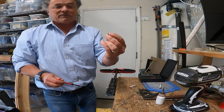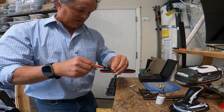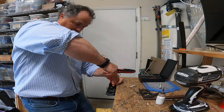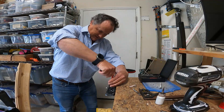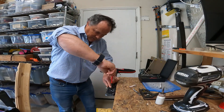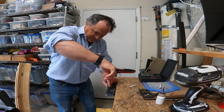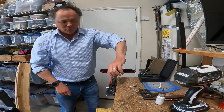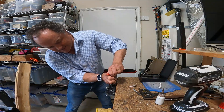We're going to take this little helicoil, and we have this tool — the tool fits on like such. We are going to thread this into the new M10-sized threads and go down until that's just flush. It's fitting in there pretty well — just past flush. Then you reverse this, and it will break off that little inside nub.